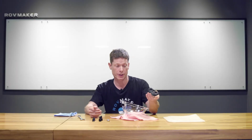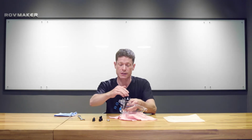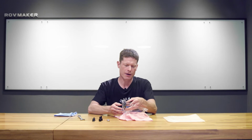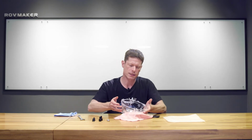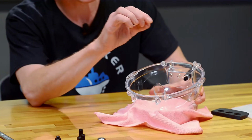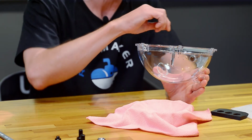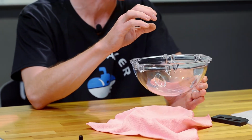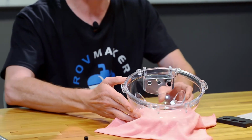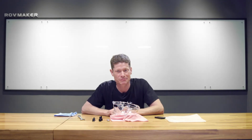To put the other 2 in, again, you will need the plate in place. And repeat the same process. Now, afterwards, if you want, as an option, to make sure that you have a very, very good seal, you can apply an anaerobic epoxy to the nut and the threads of the bolt. It will hold everything in place. And if you follow these steps, you should have no problems with your adapters. Thanks.